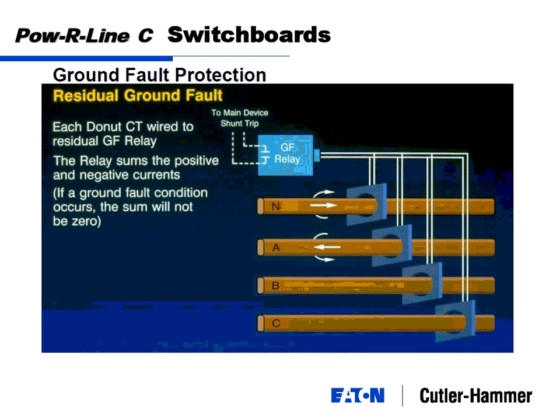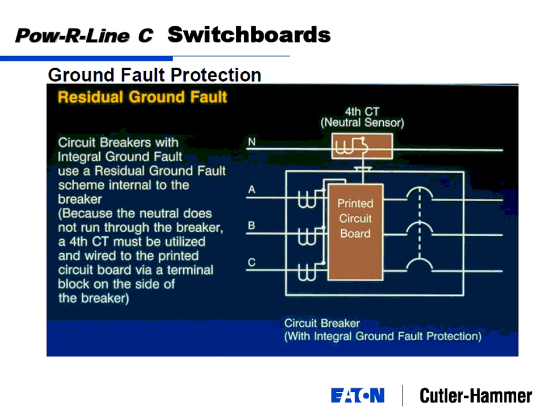At a service entrance point, we do that on the bus work. We'll go ahead and mount that itself, because there'll be a place on the neutral bus that you can mount that. So in this case, you're going to have currents going this direction, currents going that direction, and each one is going to have its own snapshot in time of different currents. And all of those CTs are right inside the circuit breaker trip unit itself. So you won't even see those. Those are behind the cover inside. The neutral is going to be external. So that'll be the one you have to run your cable through.